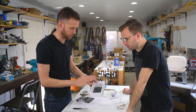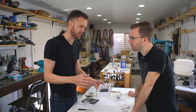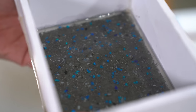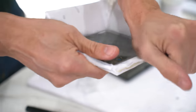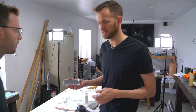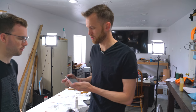There's a metallic sheen to it now that it definitely did not have before — love it. Now we wait for this to cure. We did that first layer with all the cool materials and let the epoxy cure. Then I added another thin clear coat layer on top. You can see right down through the new epoxy because it's crystal clear, and it is amazing what it does to the opal. The resin has been sanded down and is in much better shape, but I want it fully cured, so we're going to throw it in a low-temperature toaster oven for an hour to let it harden all the way.